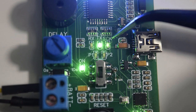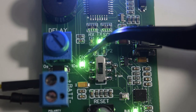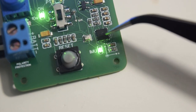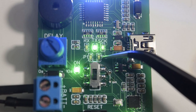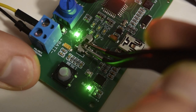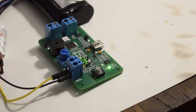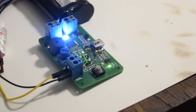Standard SCK, RX and TX serial lines and an ON LED will be seen as indicated by the bright green LEDs. An IMU LED is also shown on the bottom right to indicate power to the inertial measurement unit and barometer. Pyro-detection LEDs indicated by P1 and P2 show if the terminals have been engaged for ignition. Finally, a slide switch to regulate power to the entire board is also available dead center. A THT silicon push button, ideal for dust and water resistance, is available for quick resets to restart the loop program of the board.